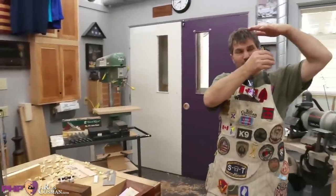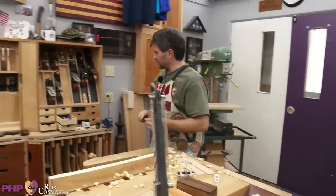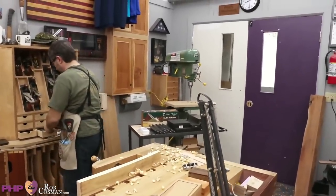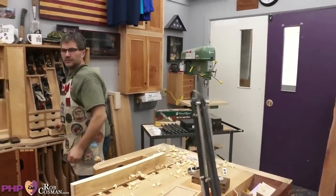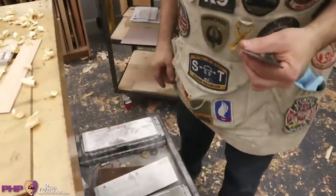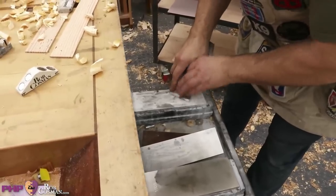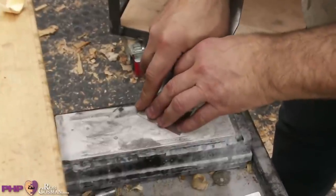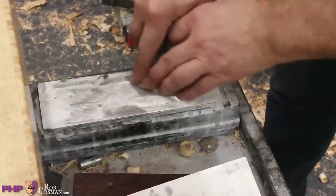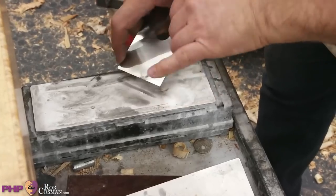You can see it. If you put it up to a straight edge, you can just see it. But I'm doing this. I've got a high angle blade. Here, I'll do it so that you see. So this is a 16,000 grit stone. It doesn't cut very fast. And the extent of my feathering is this. I'm out here, 1, 2, 3 seconds, pushing down with that finger. And then 1, 2, 3 seconds, pushing down with this finger.